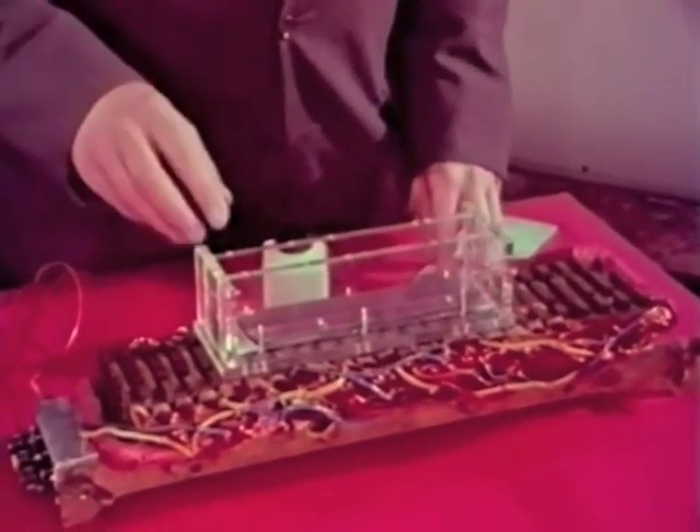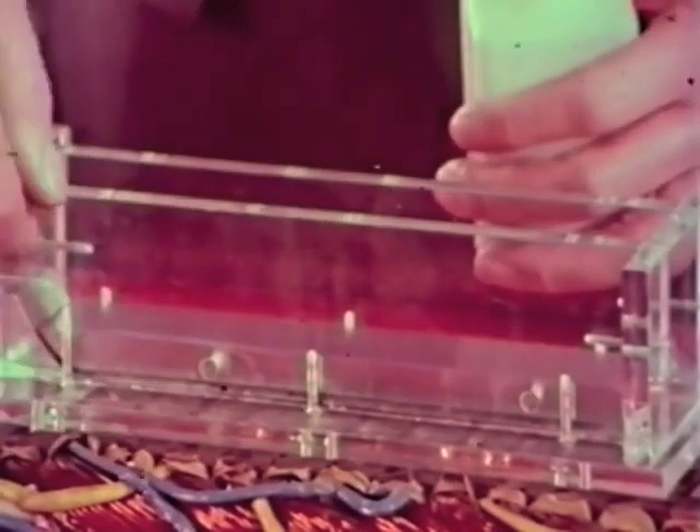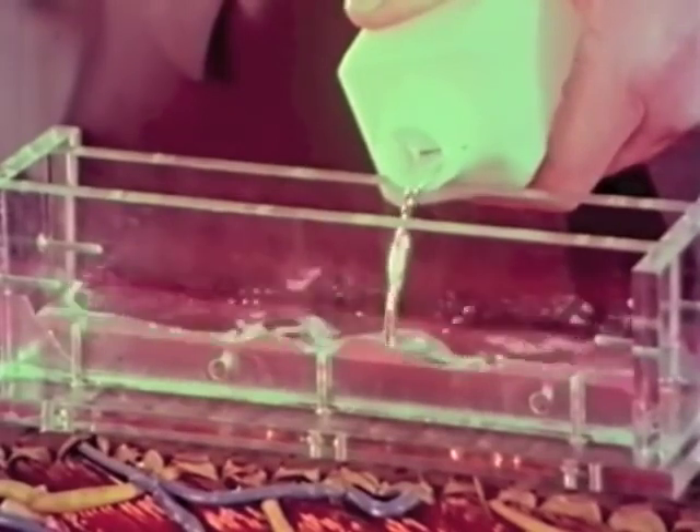In this state the gas is said to be ionized, and this whole process of gas pumping has the wonderful name magnetohydrodynamics — MHD for short. I can't show you MHD very simply, but I can demonstrate that we can pump fluids at least by pumping mercury rather than a gas. This trough has a piece of steel fixed into it to improve the magnetic circuit. When I pour mercury into the trough it's going to flow underneath the piece of steel and be pumped along the bottom, up this end, and flow back over the top. When I switch on the magnetic field you can see the mercury making a small fountain at this end.